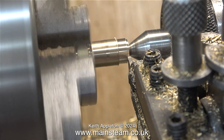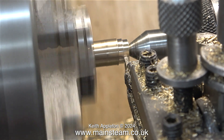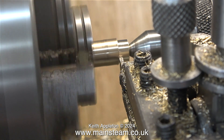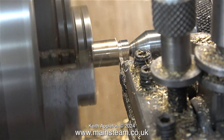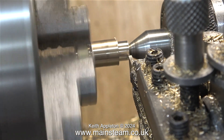This next part is not recommended — I'm just showing different ways of doing the job. I'm holding the part in the chuck by the flats of the union nut that are screwed onto the thread. And now I'm using another parting tool which is incredibly thin, and surprisingly once again this small parting tool cuts the leaded bronze perfectly.